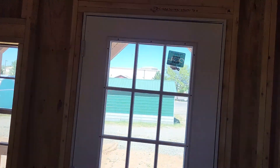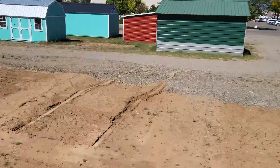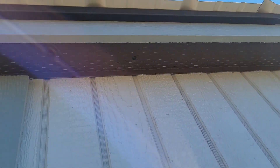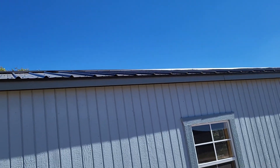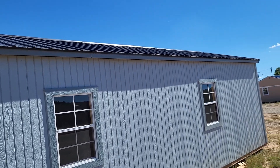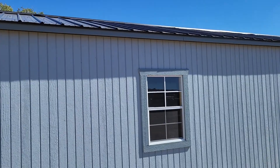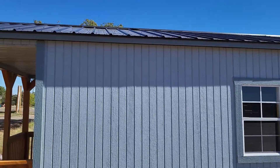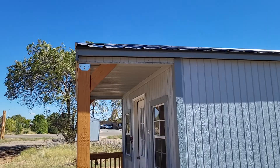We're going to go back out and I'll show you the soffited vent system. This porch is nice and comfy to sit on — point it to the west and watch the sun go down off your front porch. That's the aluminum vented soffit system. And as you can see up there on the cap row of this building, there's a little bit of venting up there, because hot air is going to rise and leave. If you're going to trim it in and wallboard it up and tape the texture, that's going to take away from the top part. But if you build it like an attic type thing, it will let the building breathe, and that actually will beat a lot of the housing requirements for buildings made in this modern era.